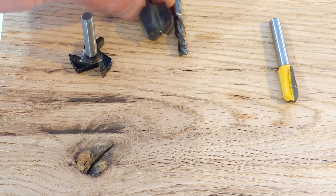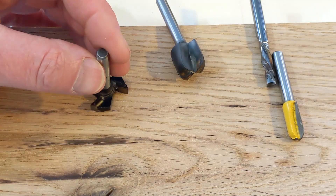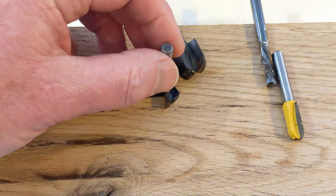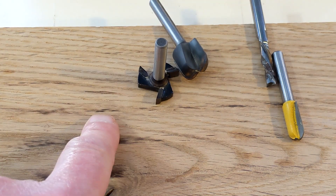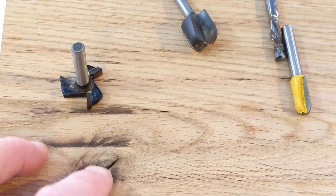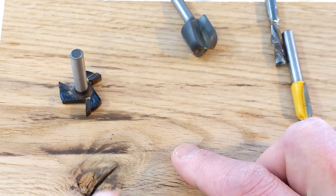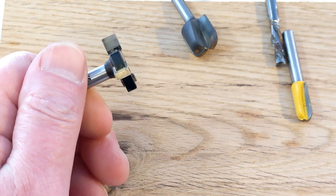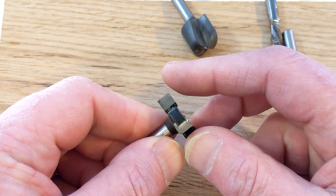What was happening on this tool was it was making a good cut along the cutting path, but this burn trail is actually from the trailing side of the tool. The cut was happening up front, and on the back side of the tool it was just rubbing and heating the wood enough to burn it. That showed up more heavily in one area because of the grain direction — the grain shifts at that spot — and when the wood is burning, the majority of that heat is dumping into the router bit at the sharp edge, breaking down the crystal composition of the metal.